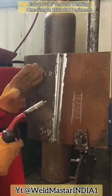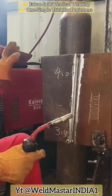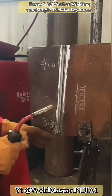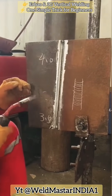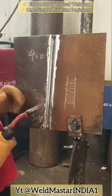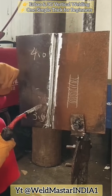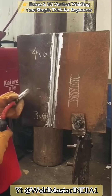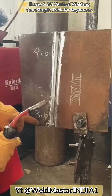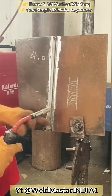This method is very commonly used in workshops. It is called a solid wire, single-sided pancake-shaped weld. We are using solid welding wire. During welding, the reference parameters are: current approximately 95 amps, voltage approximately 17.5 volts. The welding process proceeds from bottom to top. Regarding the gap, we leave the bottom gap at 3.5 millimeters and the top gap at 4.0 millimeters.